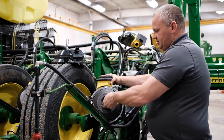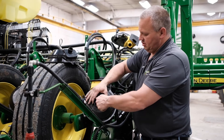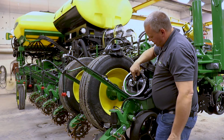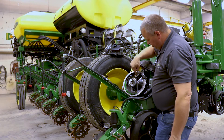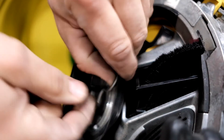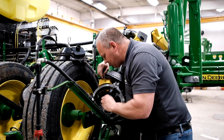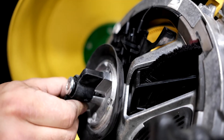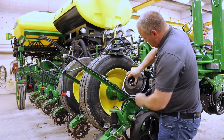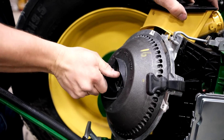When I try and turn this one, this one is a little bit loose yet too. So in order to adjust the tension on this meter, I need to take the bowl out and adjust the bowl retaining hub closer down into the meter. To do that, we have this clip right here. I pull that out and I like to go in eighth-turn increments. I turn it down an eighth of a turn, or to the next hole, and go right back into the same one I was in. Then I engage my bowl retaining lock and turn it — there's resistance to turning there.